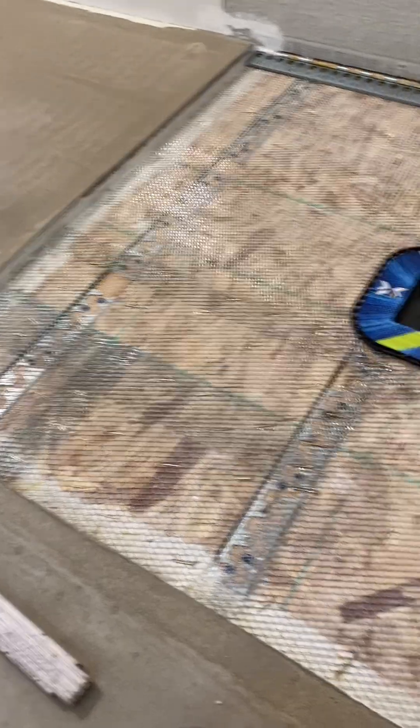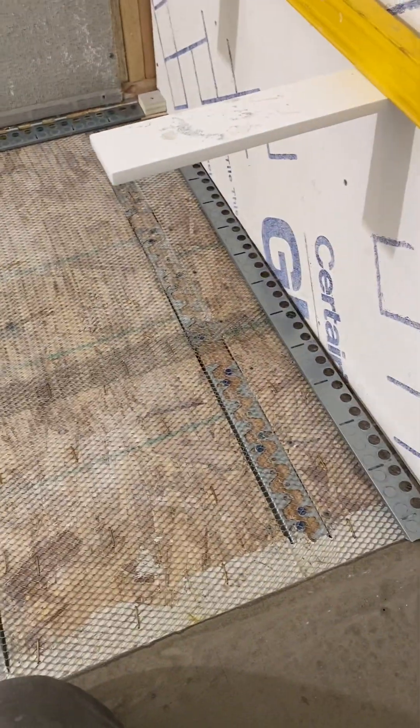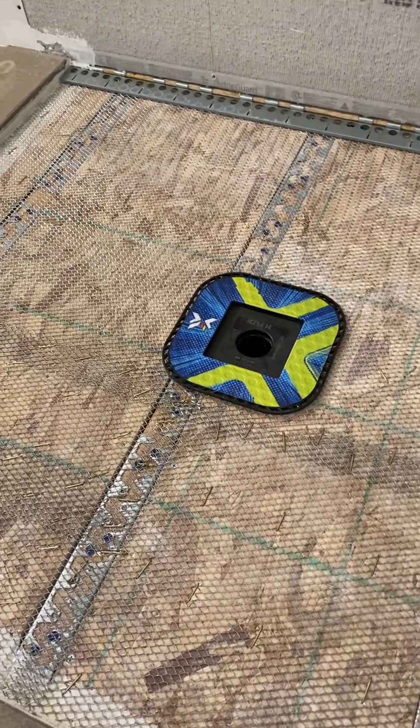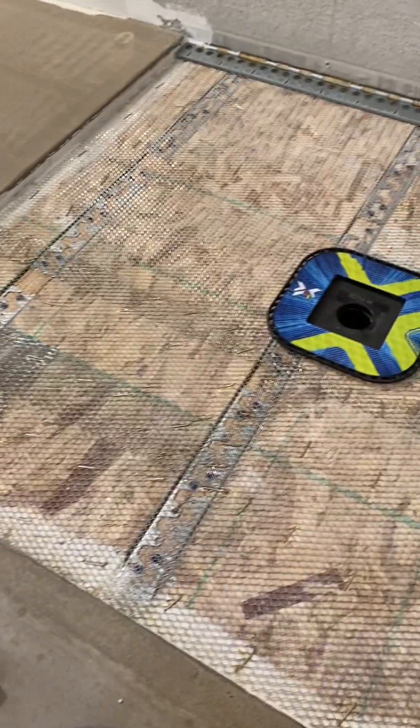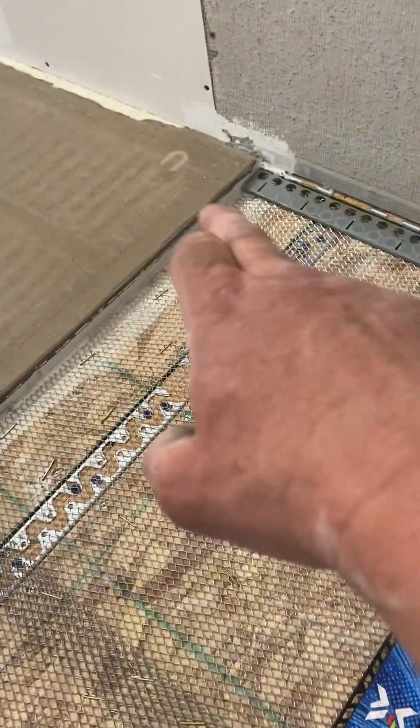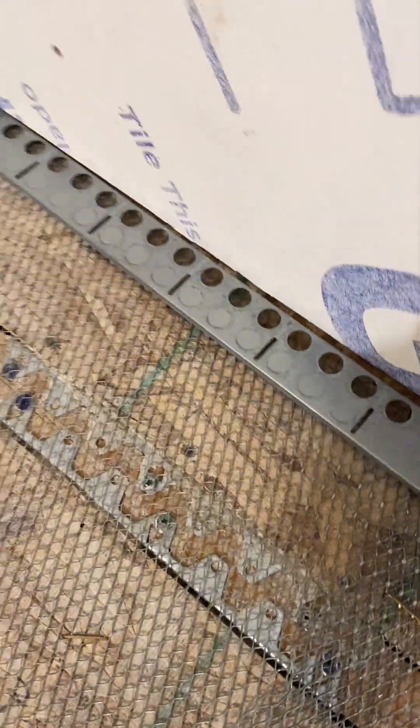That's just my opinion, that's how I do it — don't take my word for it, I'm just showing my process. I just realized I don't have any ABS glue, so I'm going to make some hard screeds, and while those dry, go grab some glue. With the 330 it's so gooey, you can't just screed it like dry pack — you really need a hard edge to screed on. I've got my level perimeter here, it's nice and hard. I set a screed pitch block in the corner, exact same height as these three corners. I'm going to mix up some 330 and set this cap strip into it, and by the time I get back, that'll be nice and hard.